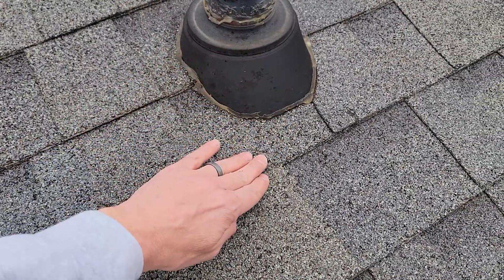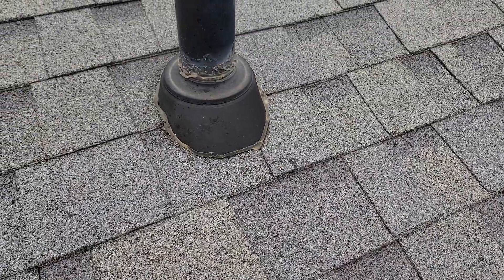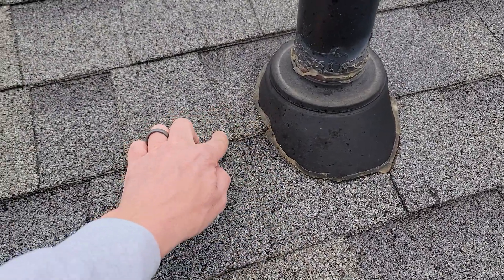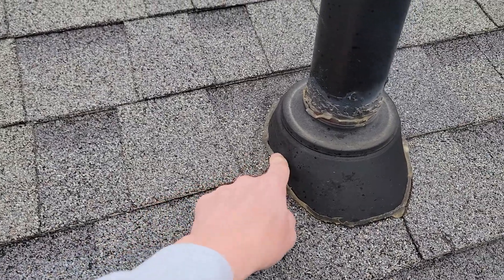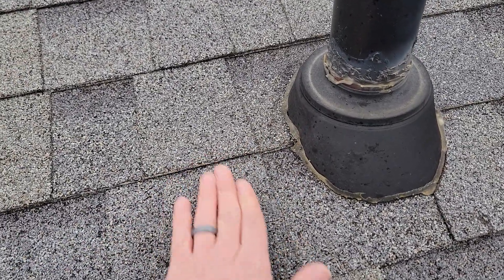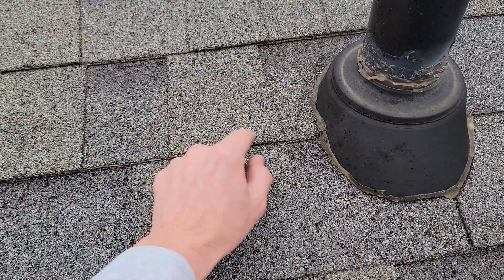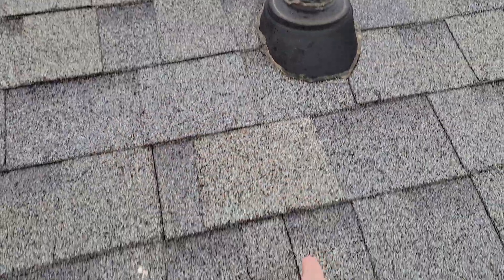In this case it's barely catching the shingle here. There are two issues with that type of install: the flashings typically don't come out very far — it doesn't matter what flashing boot it is, plastic, aluminum, steel, lead, copper, whatever — it only comes out so far. If your shingle is not up past that sufficiently, any water diverting around can easily go off the edge of it.